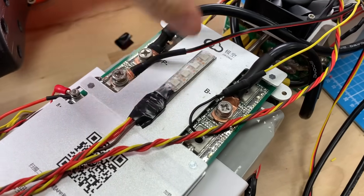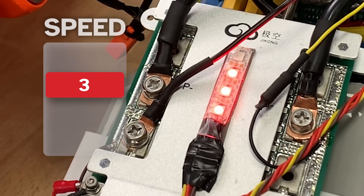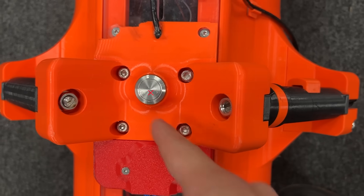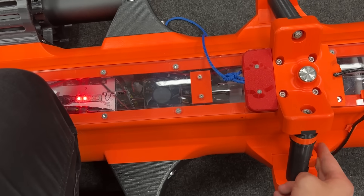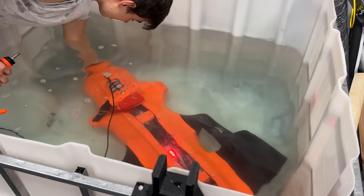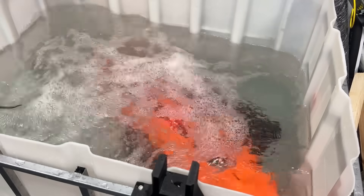Back to the initial issue. The first thing we added are four LEDs to tell us which speed mode the vehicle is currently in — now we'll always know if the speed mode changes by accident. Secondly, we decided to ditch the button. Instead, we can simply double-click the dead man's switch to change the speed mode — actually, just to make it safer, let's make it a quintuple click. That's fixed. However, when testing it underwater we still couldn't throttle very precisely, but we decided it's good enough.